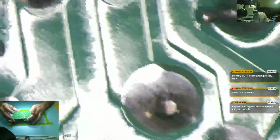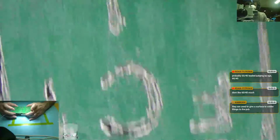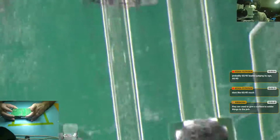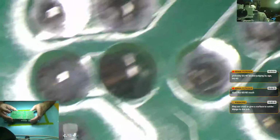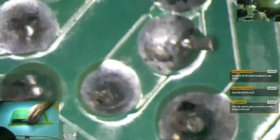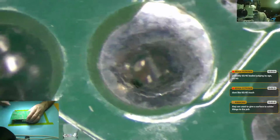Anyone say intermittent connection? So this is an intermittent problem they're having, by the way, with the overvoltage on the 5-volt line, which I guess could say feedback error. The power supply is not getting the feedback that it needs to know that its 5 volts is actually 5 volts, so it wants to boost it more. I honestly don't know. This guy has a little cracking around it as well.